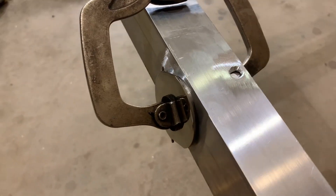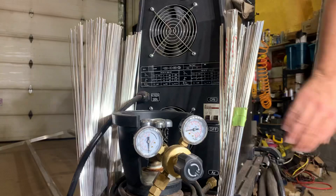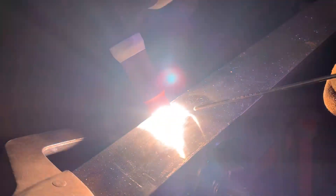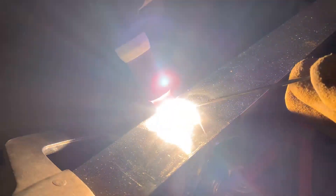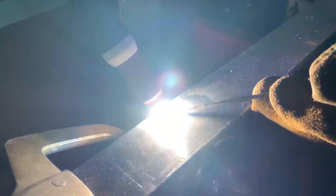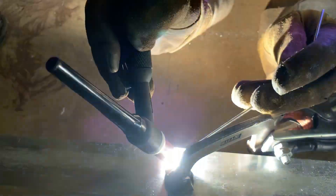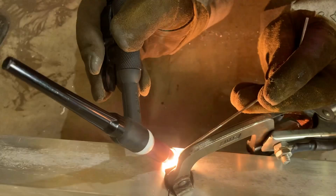So I've got the pipe in place pushed in with a clamp. You can see the hole I've made at the top for a plug weld and also one on the back. Fresh gas. Welding a small plug weld like this is actually quite difficult for me. I'm trying to get the heat down to the bottom of the hole so I can hit the pipe, but the hole is so small it's very hard to get the tungsten, the arc, and the filler rod all in at the same time. It seems to be working, but I may have to do it in multiple stages because again I'm using the thumb switch not the foot pedal, so controlling heat means I can only stop and start. The hole on the back is even smaller and therefore even more difficult. When things get too hot I simply stop and then start again.